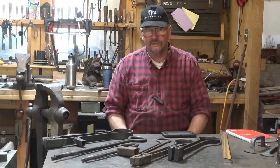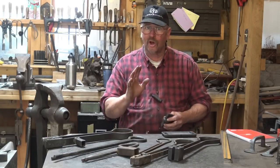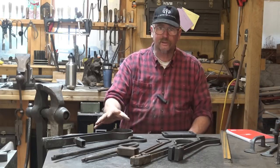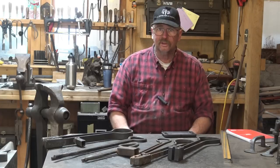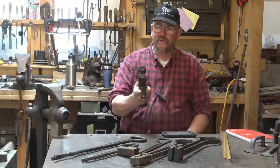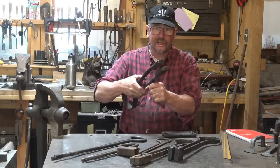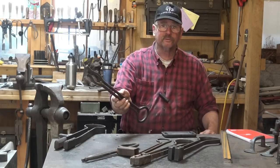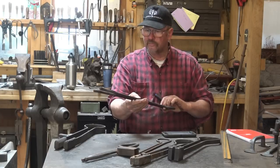The guy that suggested it is the genius. So what would a spring butcher be? What does that mean? We haven't really talked much about spring tools yet. I've got some spring tools here, and a lot of these are power hammer tools because I don't use a lot of spring tools at the anvil — but they're absolutely useful at the anvil. This is a big set of spring fullers for use under the power hammer. This is a very simple spring fuller, and we'll make one of these today just for use at the anvil or by hand.